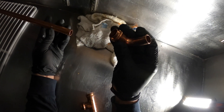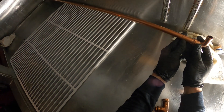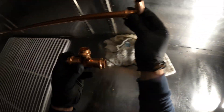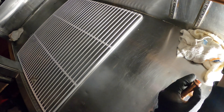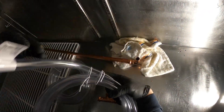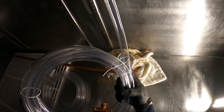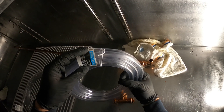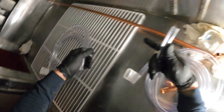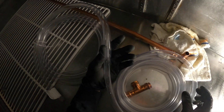Can I go through the other side? I'm gonna need to make a hole in there too. So it goes through the hole now. This piece right here is a street elbow, so I'll be able to go directly with the plastic hose from there. You want this a little bit at an angle so it can drain. And then for that one we're gonna use a tee and tee off in there. We need the right sizes here - this is 5/8 so it goes right above perfectly onto this half inch copper. This half inch piece goes directly on there perfectly.